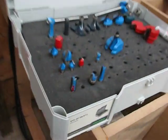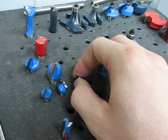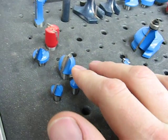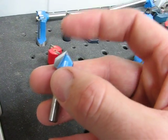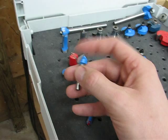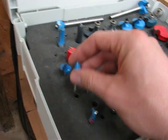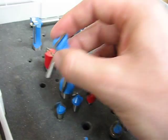I can kind of show you some of my other lesser used ones. Here's a 3/8 core box — I'll use this for fake raised panels too. Another raised panel bit from Rockler that I use for borders on text boxes and things like that. And then this is the one that came with the machine — a 90 degree V bit. I think the 90 degree is just a bit too steep; I may look for a 135 degree bit before too long. And then here's another fake raised panel bit that I use occasionally.